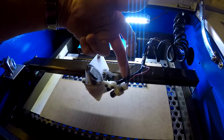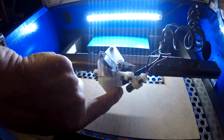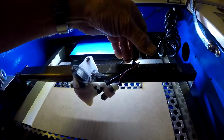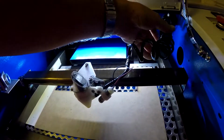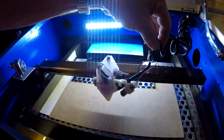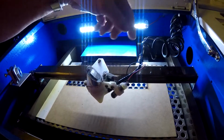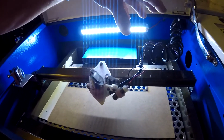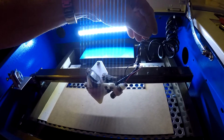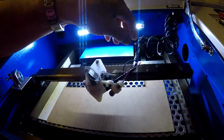As you can see, there's a black tube that comes off from the air assist nozzle. It's fastened on there. This is actually air hose from an airbrush. I got it off eBay for about £12. It's quite long. I found this better. The silicone tube from the fish tanks, 6mm diameter silicone tube from aquatics supplies, is fine. I did use that, but I like this better.